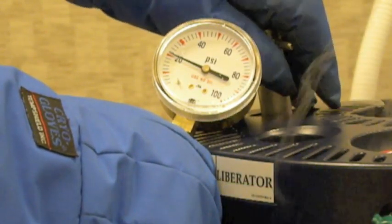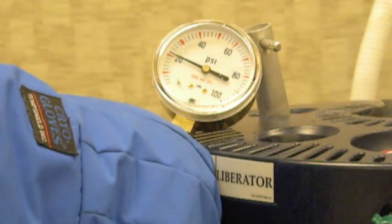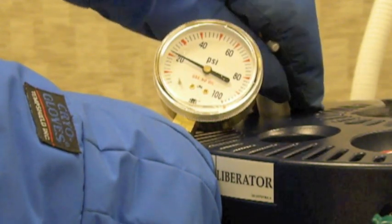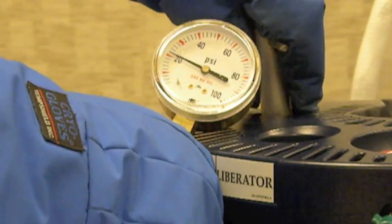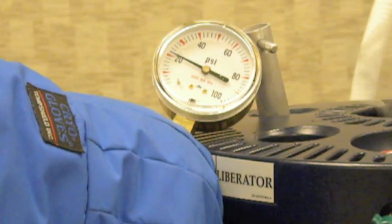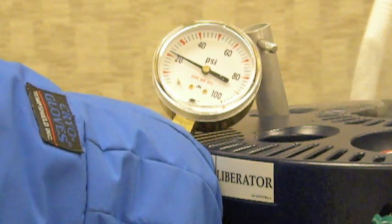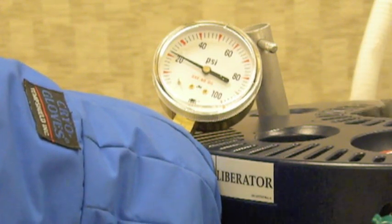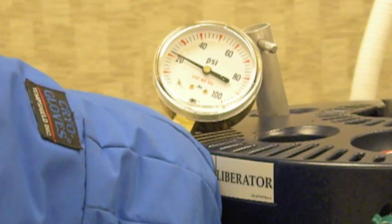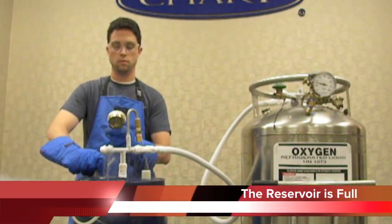Ideally, the pressure should be right at the operating pressure of the economizer valve on your reservoir, but 18 to 24 psi is a good range for all CARE tanks across the board. If the pressure gets a little too high, you can open the vent valve a little bit more to lower the pressure. If the pressure gets a little too low, you can close the vent valve a little bit to raise it. Basically, the entire time you're filling, you throttle the vent valve open and closed using the wrench to keep the pressure where it's supposed to be. This is crucial — if the pressure is too high or too low during the fill, the tank and the portables filled off of it may not operate properly. Continue to monitor the pressure until the tank is full.